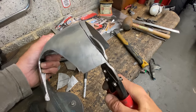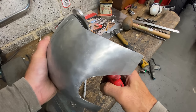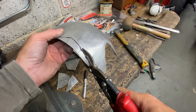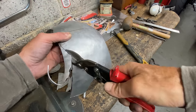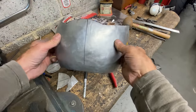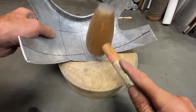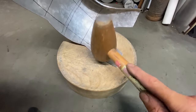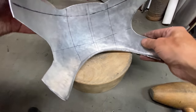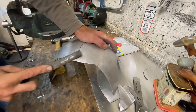So now I can use my tin snips to trim it to size. With the fairing trimmed down, I now use my bossing hammer to go around and planish out some of the smaller marks — this could take quite a while. With the shape basically finished, I go around all the outside edges with a half round file to remove any burrs.